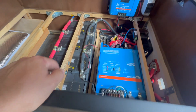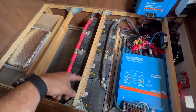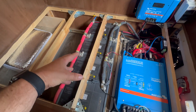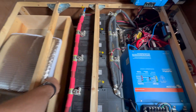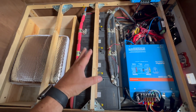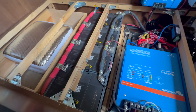With the amount of battery this customer has, they were likely not going to be doing that — maybe two to three hours if you've got good sun. The customer is using these Lion Energy Safari batteries. These were really hot a couple of years ago; we don't see them nearly as much anymore. The biggest reason is probably just that they're not efficient on space — you can get so much more storage capacity in about the same footprint. Today I could probably fit easily 600 to 800 amp-hours of battery in the same footprint where we've got 420. That's probably why we're not seeing Lion Energy batteries used quite as much, though it's still a darn good battery.